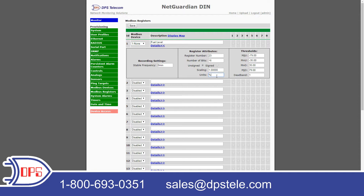For units, I'm going to put percent since I'm interested in a percentage fuel level. Now for thresholds, you fill these out to trigger threshold alarms. I'll adjust these to something more realistic for my fuel level example: a major under at 25% — that's when I really want someone out to refill the generator. A minor under at 50% to get it on the radar. Minor over and major over don't really make sense here, so I'll just put those at 105 and 110 since there's no real scenario where I'd be seeing those alarms.